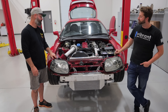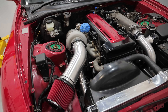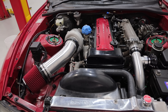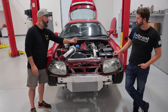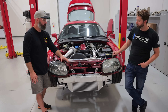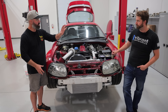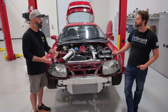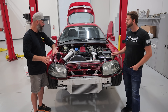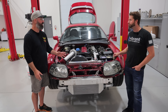I got to say, you did an awesome job — thanks so much, Greg. It really turned out beautiful. You've got the perfect amount of clearance around everything, and using these smaller pipes did make it easier. We went down to a two and a quarter inch diameter tubing on the hot side and two and a half on the cold side, versus the Freed intercooler which was set up for three inch and three and a half inch. And you've actually done some math on that to back up the theory of this giving us a more responsive setup. The calculations showed the Freed setup's intercooler and piping together was 23 liters in volume, and this setup is 13 liters of volume.